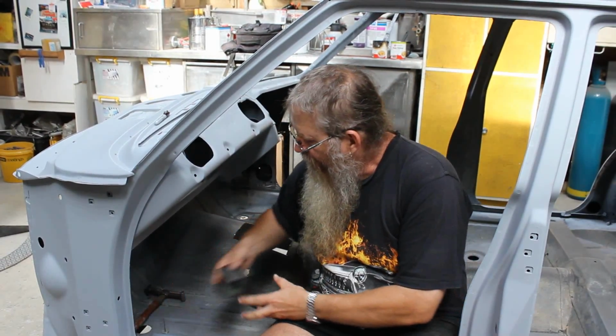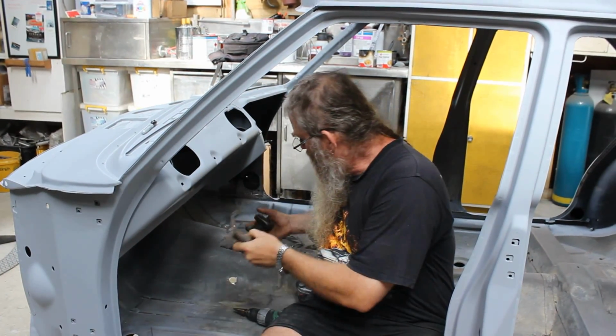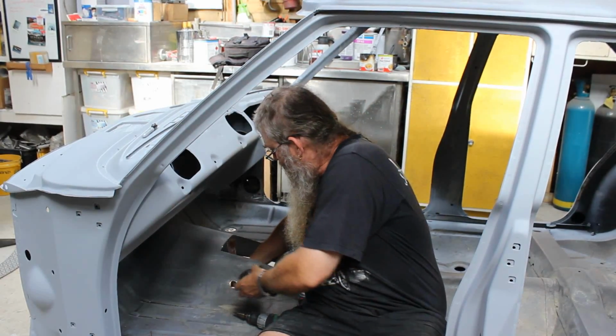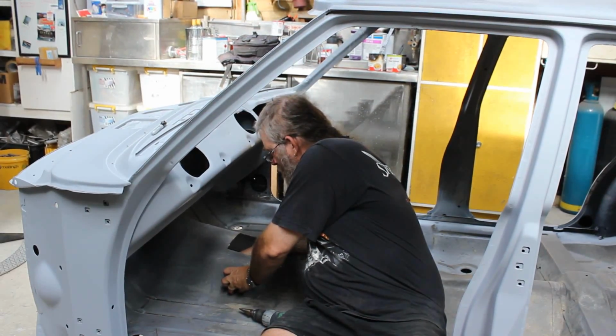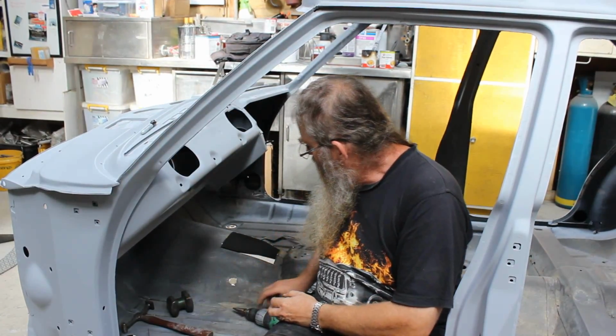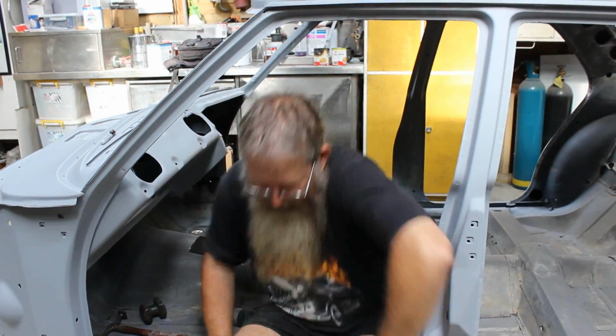I've then gone through and just basically dressed everything up with the hammer and dolly just to make sure that everything is exactly as I want it. So now the hard thing is we've now got to fill in this hole, and I'll show you exactly how we do that.